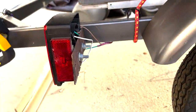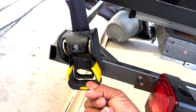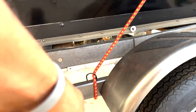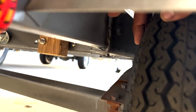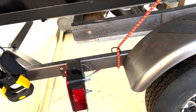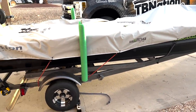The only thing I kind of bootlegged was cutting off and re-riveting using stainless steel rivets. Once I started getting the hang of it I just re-blasted right over the old welds, recut through them, and made them better. I got these Stripper buckles — a little nicer looking than standard boat buckles; I'll leave a link in the description. I should add more little pad eyes and D-rings. There were some bolts back here holding things on, but once I started banging on it it shook, so I came in and gave it a little weld seam and that stiffened it up substantially. If that weld ever breaks, the hardware is there to save the bar.